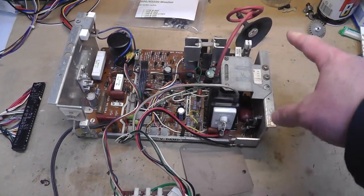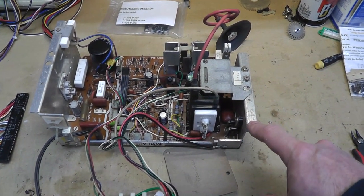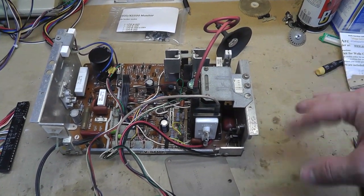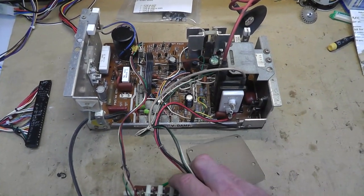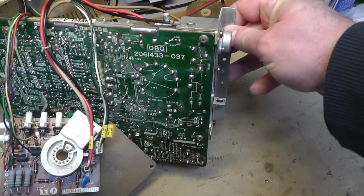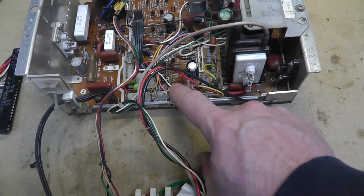However, you've got to be careful when you're swapping around K4900 chassis. You want to make sure the yoke is compatible with the chassis. There's certain chassis, due to the vertical deflection of the yoke, that are not compatible. I'll link to a thread on KLOV where I posted some information about this, and I actually posted information about this specific chassis. I had done a video where I fixed this chassis. I had a cracked neck board, and the neck board's a -017, and this chassis is a -37, which is fine. I believe it will work because it has a vertical dampening pot.